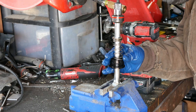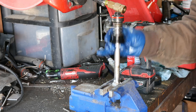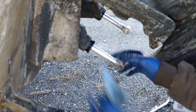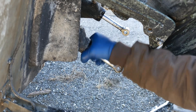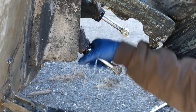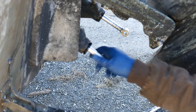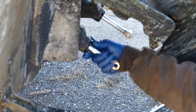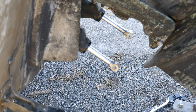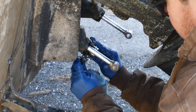Reinstall the piston and securing bolt. Back at the boat, reinstall the piston and shaft into the trim housing and hand tighten the trim ram cap. Then using the pin wrench, tighten the trim cap fully.